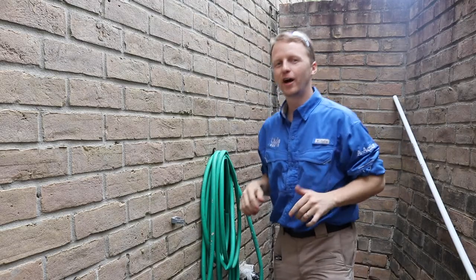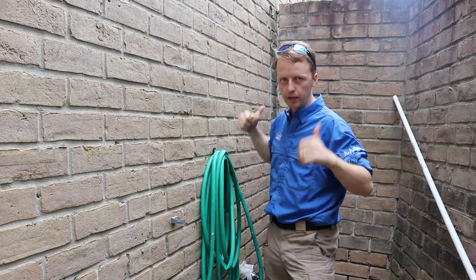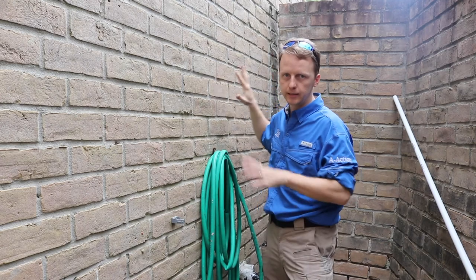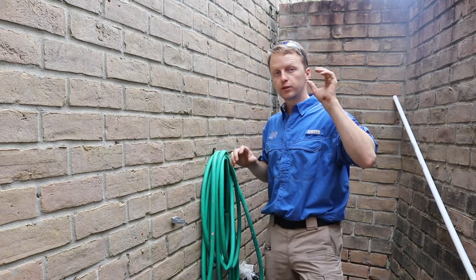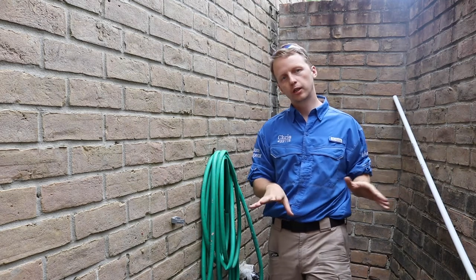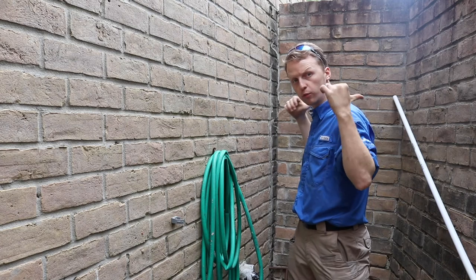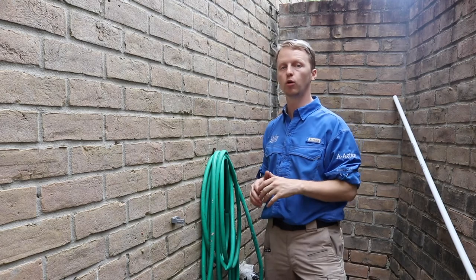For the real last find on this video, I noticed that this brick wall was actually leaning to the side a little bit. This didn't raise my concern too much on the main structure, because I didn't see any signs of stress indicators on the main structure itself. This probably came from poor drainage in the backyard. But with this wall showing so much deflection and leaning so far over, this is definitely a safety concern, and it did make it into my report on this property.